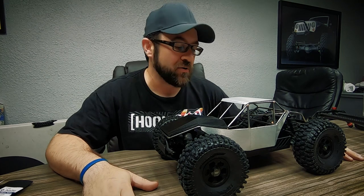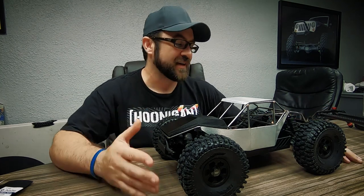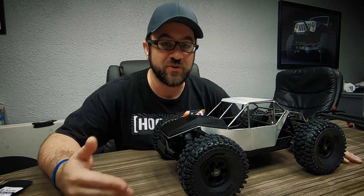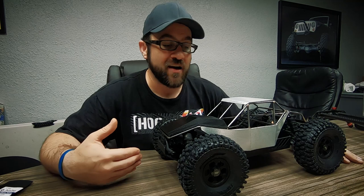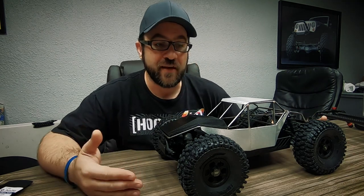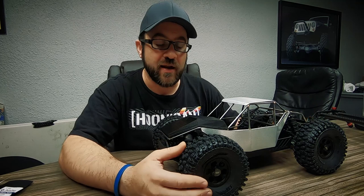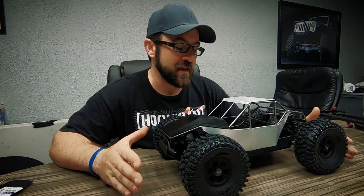I'm going with a slower motor than Matt — only about an 1850 KV motor with around 13.9 to 14-to-1 reduction. I'm trying to not make this thing too fast. Part of our initial qualification involves going slowest from two distances, so I'll have that slower motor and I'll gear down as low as this thing can facilitate. I want that slow-speed control in rocky terrain, so I'm really trying to find that mix.